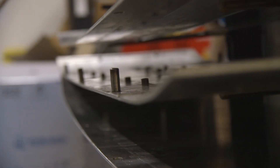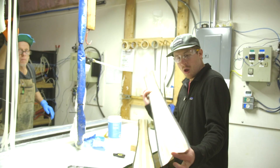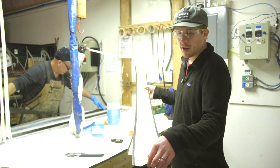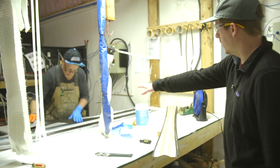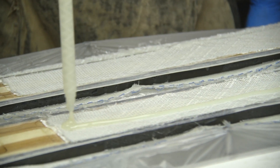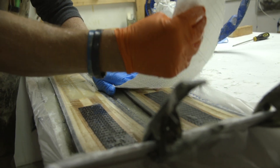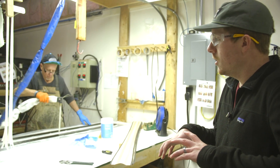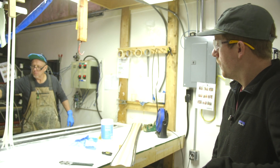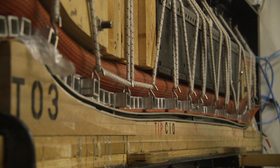Over here with Papa John — my father John — we have the new Mohawk skis, which went through a year of development. This is a beautiful ash and aspen core with laminated sidewalls. He's laying carbon down on the ski — a layer of fiberglass, carbon fiber strips, strips of rubber. This ski will also have magnesium inserts in the core, fiberglass, and carbon-reinforced pockets milled out of the core to reduce weight. In another 15 minutes everything gets sandwiched together and loaded into a press.